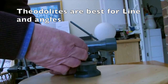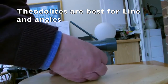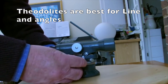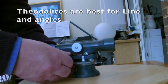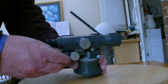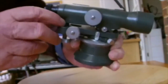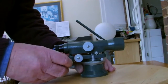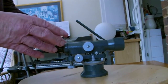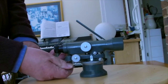This one here focuses it, and there's a range of about two miles. Down here we have a rotator graded off in degrees which you can lock, and when it's locked you can then do a fine adjustment with this one. There's a spot level here — you get that bubble in the center just like a target. The only disadvantage with this level is that every time you use it you've got to look in the mirror and adjust the level.